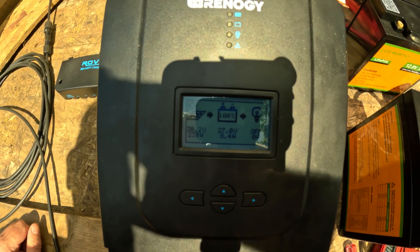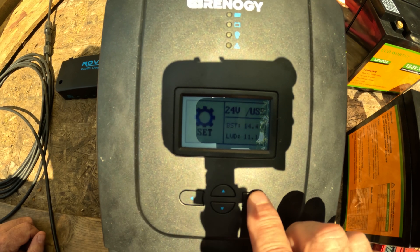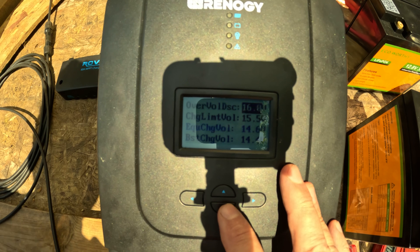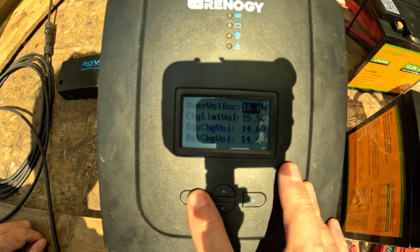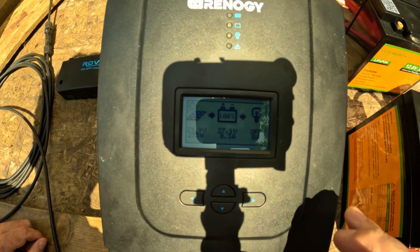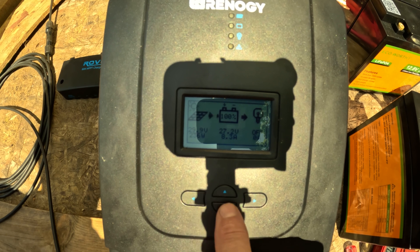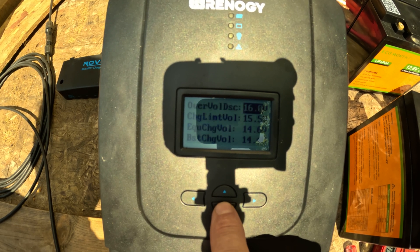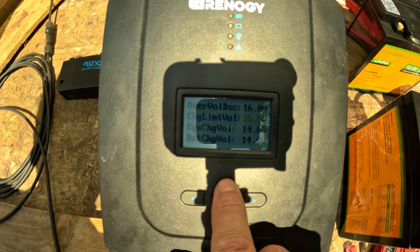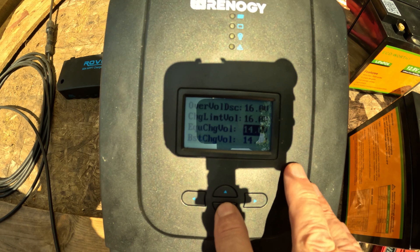Fault is null — so it's actually working. Let's check: charge limit is 15.5 volts, so it should still be charging even though it's saying 100%. Approximately 13 volts — interesting. Let's look at the settings: it's on user 24 volt. This should be 31 volts there. Let's crank it up — charge it at 32 volts and see what happens.